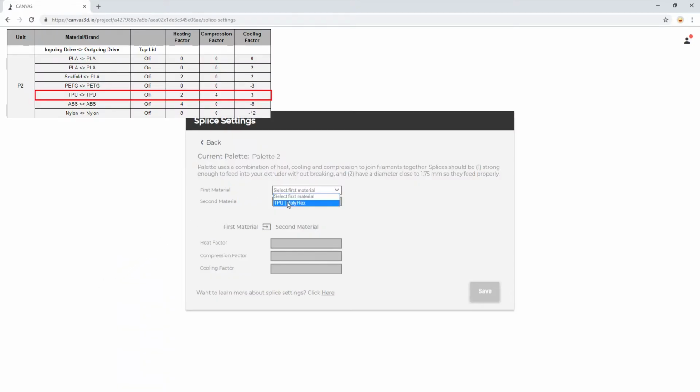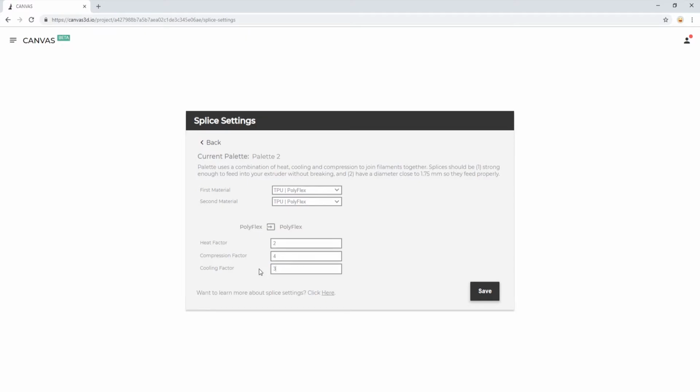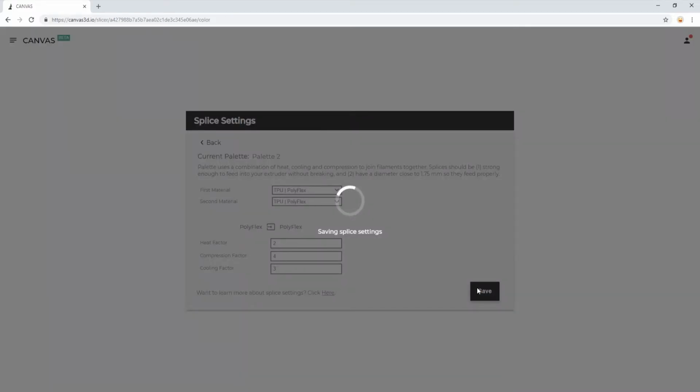Now we select our two materials we wish to customize splice settings for. In this case, we are adjusting the splice settings for splicing TPU into TPU. Please note the splice tuning guide linked in the description. This guide has splice suggestions for other filaments. These should get you pointed in the right direction for multi-material splicing. For most TPU filaments, we typically use around 2 heat, 4 compression, and 3 cooling. All we do now is click Save.